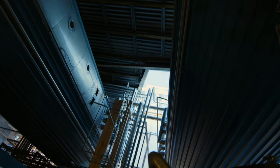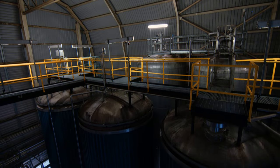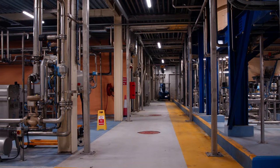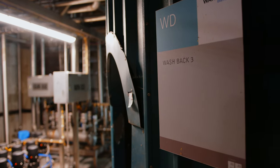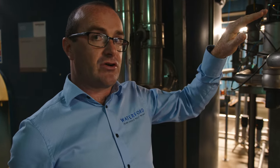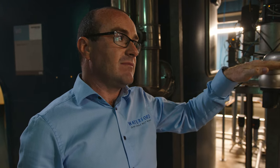These are the tops of the fermentation tanks. We have three tanks full of wash. The wort is sent down to a wash back down the corner. There's a glycol supply on the outer skin of the fermentation vessel, which allows us — after about 16 to 18 hours of the primary fermentation when heat is generated and temperature rises — to introduce glycol to cool it at around 28 to 30 degrees.